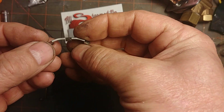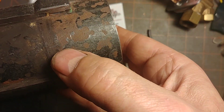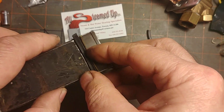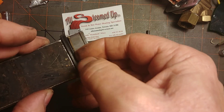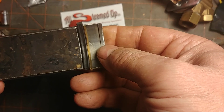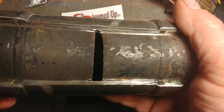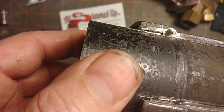This ring here is pressed into the pipe — this is what grips it and keeps it from coming apart. You can see where it was pressed in to keep this from blowing apart. Then there is a brass ring which contains the rubber as it's pressed into the pipe and forms the seal. You generally have to do some prep work — cleaning off any high points, removing any scale — before sticking this together. You can see the cross section of the material there.